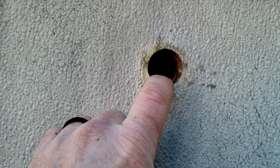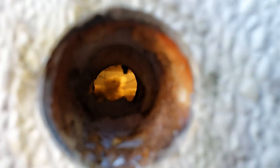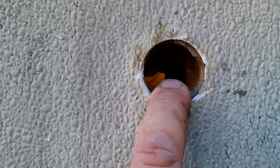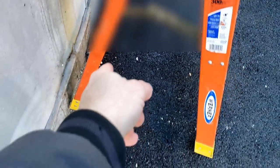We'll have to drill that hole out a little bit bigger, unfortunately, but we'll get her done. We've got our PVC here — the hole is a little smaller on the inside than it is on the outside so we're gonna have to do some drilling, which is never very easy through that much material. A step bit ain't gonna work, so I tried going in reverse with my hole saw, kind of putting the edge of the bit up there to get it to eat into it, and once that was done I could level it up and get right through. Now we'll get that 90 on the end, then do the 45s out here and bring it out, down, and back up again.